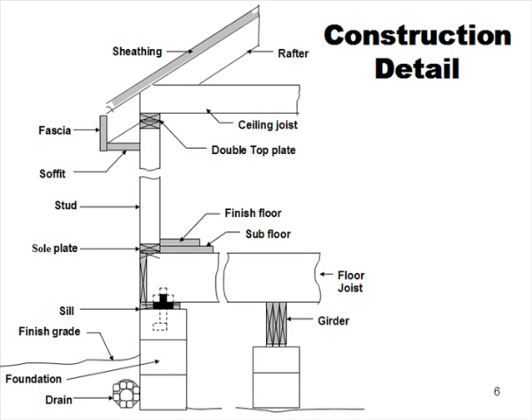If you're going to chop up somebody's house to run ducts, refrigeration piping, or wiring, you should understand how a building is built. On a NAIT exam they pay particular attention to this for good reason. Understand that a stud is a vertical member; a joist — whether in the ceiling or floor — is a horizontal structural member; and rafters are always on an angle. You're not going to see a wall rafter — there is no such thing.